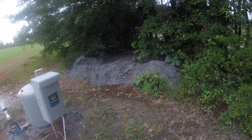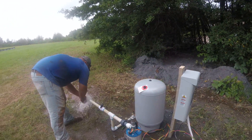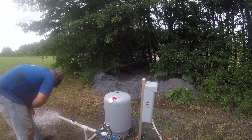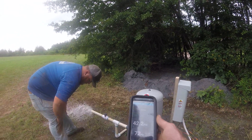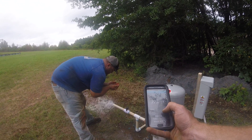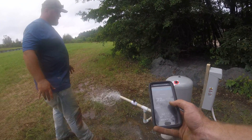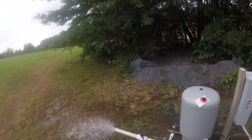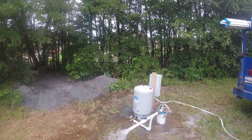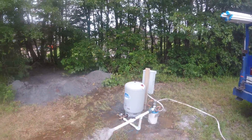Just got done finishing up a new install here, firing it up and seeing what it's doing. You can see it's running — watching it on my phone — 42 pounds, 7 amps, current balanced on each leg. Looks pretty good, we're gonna leave it alone and get out of here.